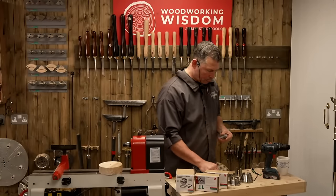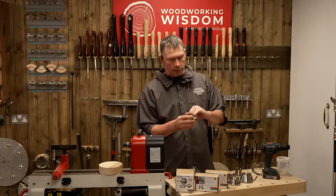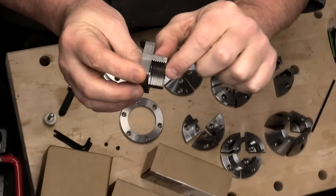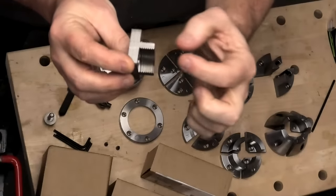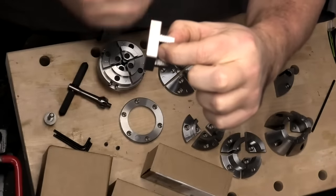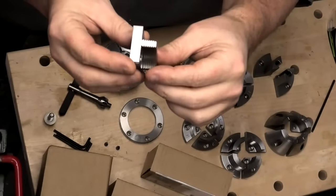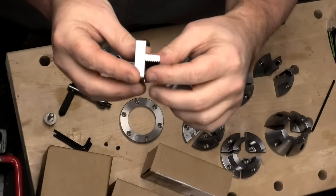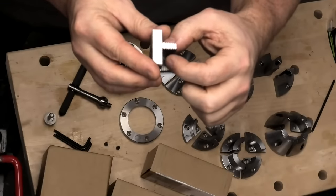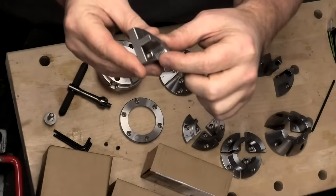Lastly, one of the little gripper jaws. In SK114 and SK100 speak, these are known as a Dove H. So this is the Dove H, a really nice gripper. It has teeth — these are designed to bite in and actually bruise the timber. They bite in, so the tenon or recess you create can then be taken away and cleaned up afterwards. But they give you a really, really secure hold because of all that surface area with different serrations — a huge amount of bite power.